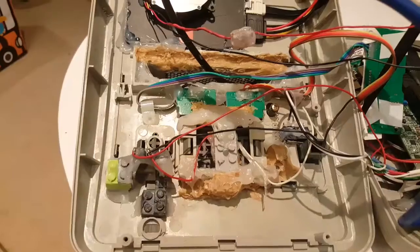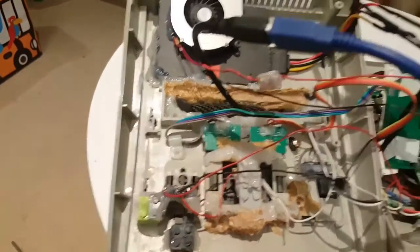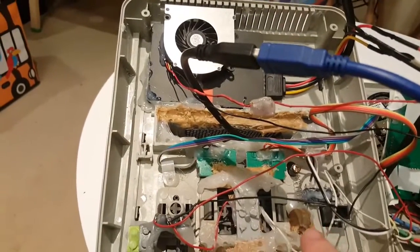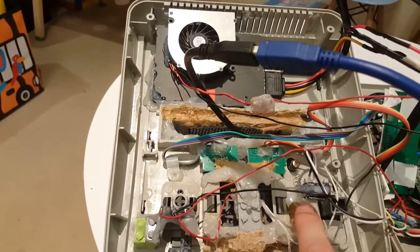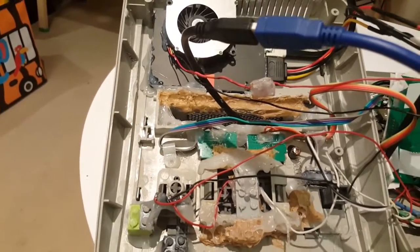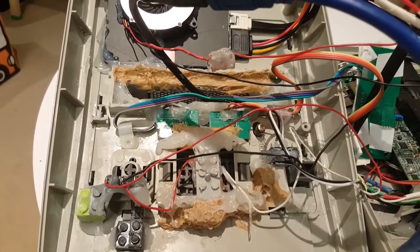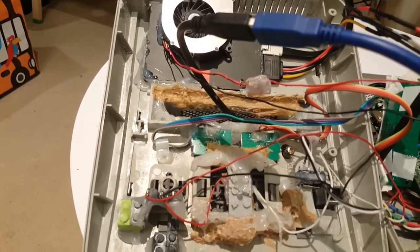Let's have a look inside. Just a standard micro switch — a really small micro switch here — and one on the power. A lot of people use rubber bands in this scenario but I opted not to. The reason is I found that rubber bands after a couple of years just disintegrate and break. So I might as well just use a spring. I just pillaged one from a pen and it works pretty well.